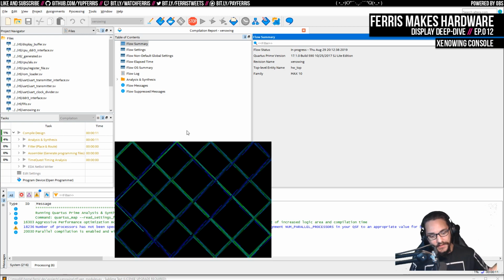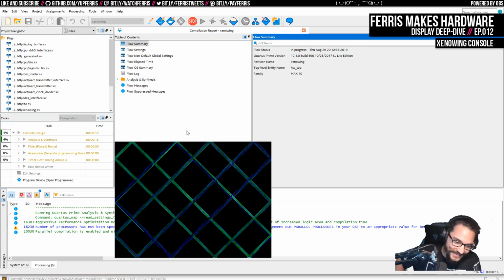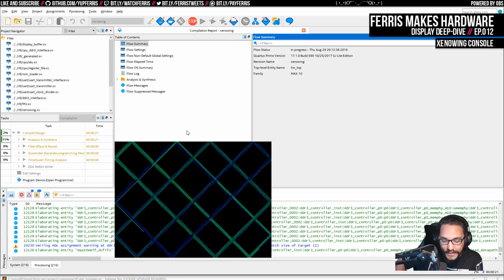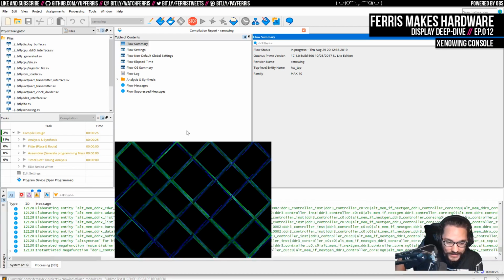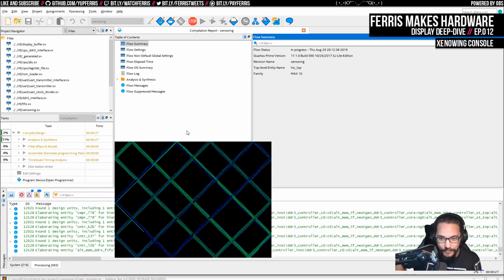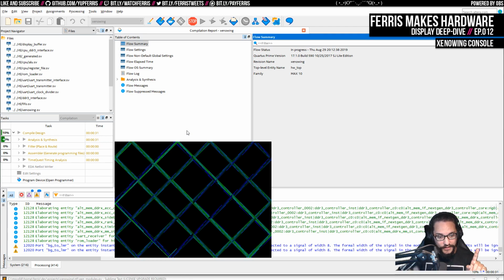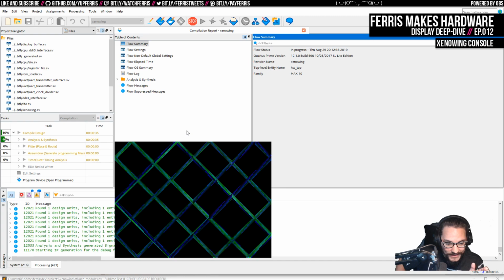Yeah, then with the GPU too, there's a whole matter of texture filtering, which I'm going to not do at first, but eventually I might want to do it. The thing is, most of those features, in terms of the GPU implementation, shouldn't be terribly difficult. But it probably means that the GPU pipeline, as the pixels go through it, gets longer. The throughput should still be the same because that's going to be bound by our bandwidth into memory. But then the latency is higher.